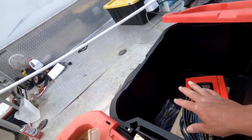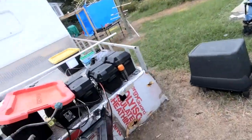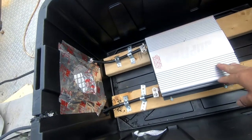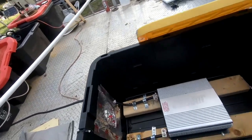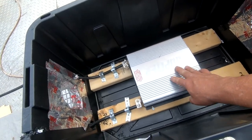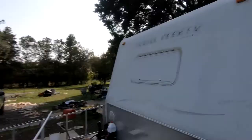Anyway, I'm very happy with these panels that Chad found for me. This enclosure needs to be totally redone — it needs to be fireproof with proper air cooling and ventilation holes, which it doesn't have right now. I'll pull the fuse tonight so there are no issues overnight. I built this box for the power inverter — it's elevated with air cooling on both sides, which is fine. I'd give Jupiter a very poor review on this modified sine wave inverter; I'm going to get a pure sine wave inverter instead. Also keep in mind with lead-acid batteries you can only use about half the capacity. Thanks for watching — keep it real.